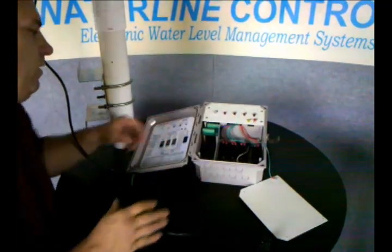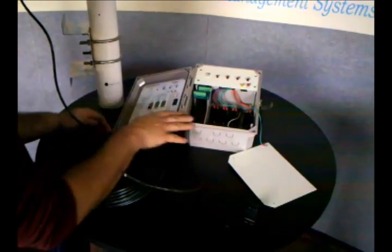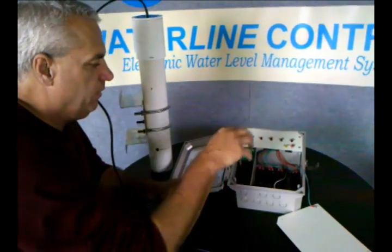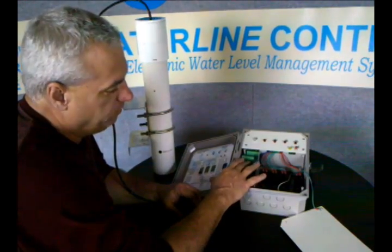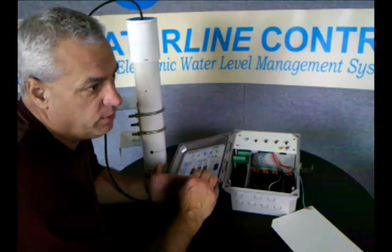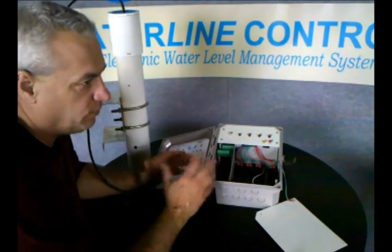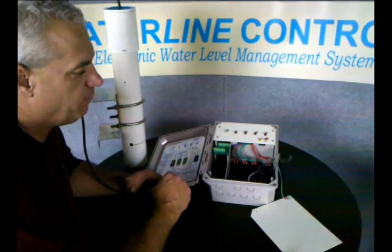It's all in one enclosure. You mount this outside the tower, the wire comes 50 feet minimum, so you can mount the controller outside the tower and the sensor inside the tower — it's all one system. The nice part is that it's all modular construction, so when the PCB fails, you just replace the PCB part. When the relay fails, you just replace it by itself. You don't have to replace the whole kit. I tell people it's like buying an airplane — you don't have to replace the whole airplane, just the parts. So the controller will last the lifetime of the tower.